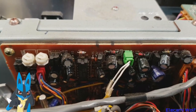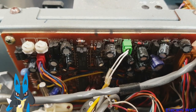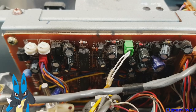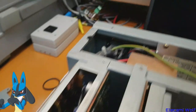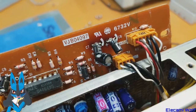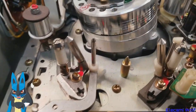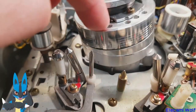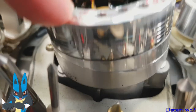On this board you can see how the leaking capacitors have started corroding the parts around them — the diodes there have green crust on the legs. On here there are stains on the board around the capacitors. What a shame, because there are hundreds and hundreds of capacitors in this machine, and they're all doing it.